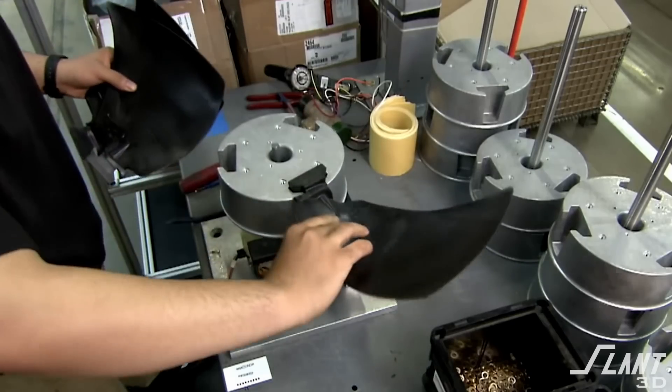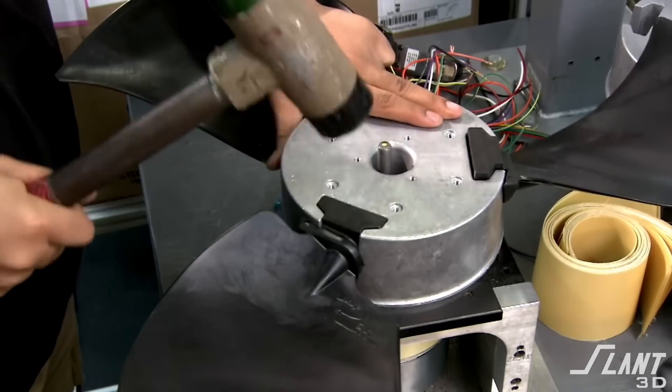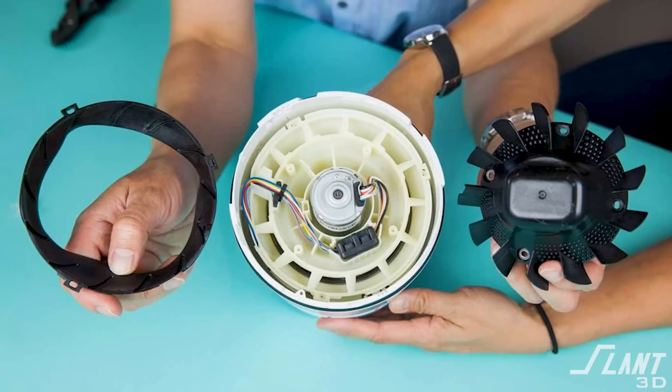But this system has some trade-offs. It is much more expensive to manufacture than just a standard propeller. With a standard propeller, you have a mold and then you shove it on the front of a motor and you're done. With the Dyson fan, what they actually have to do is stamp an inner ring that is the airfoil and then stamp or mold the outer ring that contains it all and lets the airflow through it.